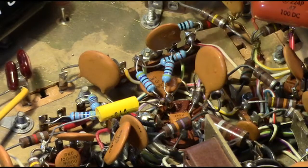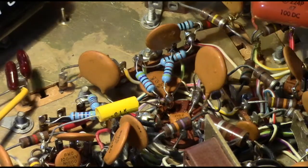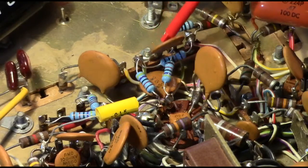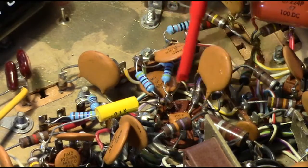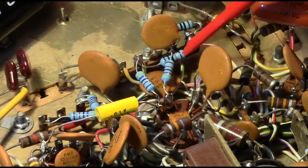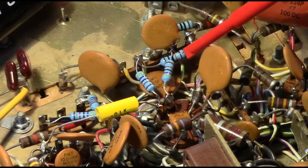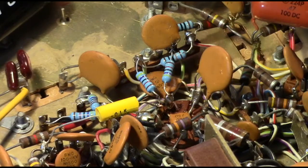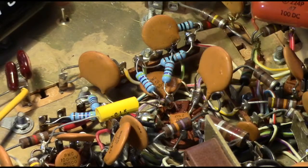John the Master Solderer has finished his usual fine job of soldering and getting into those tight little places that my shaky hands can't get into. We have replaced those six resistors — three matched resistor pairs — matched up as close as we could get them. All the little blue ones you see are the replacements, in the balanced modulator circuit. This modification is supposed to help stabilize the frequency and make it drift a lot less. All-tube transceivers are known for drifting, but the modifications we've done should go a long way toward stabilizing that habit.